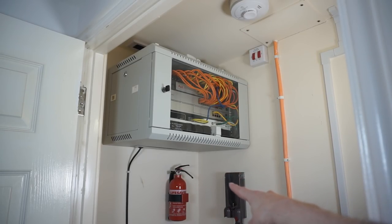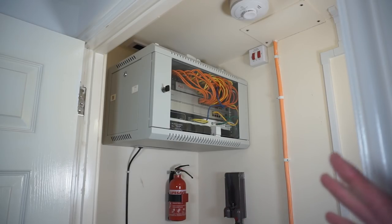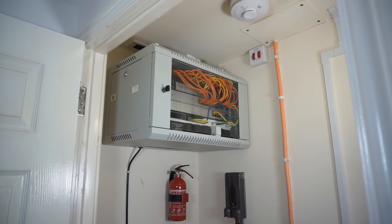There's no stud on the right-hand side or the left-hand side of the wall, which is weird, and in hindsight, that makes me even more nervous that this is mounted to the plasterboard, because the plasterboard doesn't seem to be screwed up very securely. In fact, if you go onto the wall on that corner there and push on the back wall hard enough, you actually see a little crack in the paint where the two walls join. So I don't think it's really securely mounted at all at either side, which isn't very good.